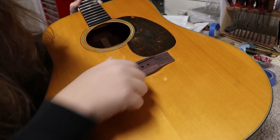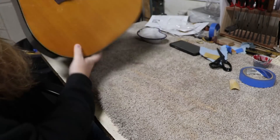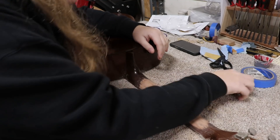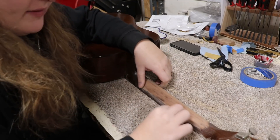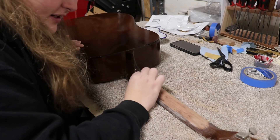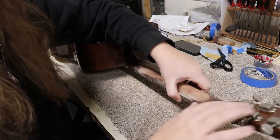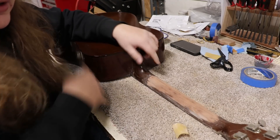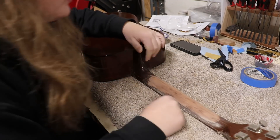This sat up overnight and you can see the bridge glued on there really well. I think it's looking really good, and that means I can get started on the next section of this job. We're going to re-lacquer this neck. You can see I've been sanding on it for a while, just trying to get it smooth because it was really beat up. I'm thinking I'm just about done smoothing it out. I'm probably going to take the tuners off, wrap the headstock, tape off the body, and leave a little bit of the old lacquer so I can blend it all together.